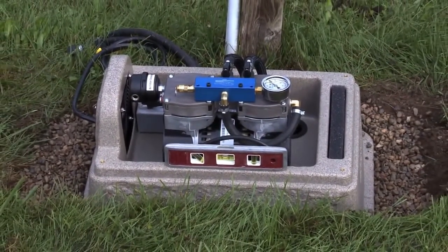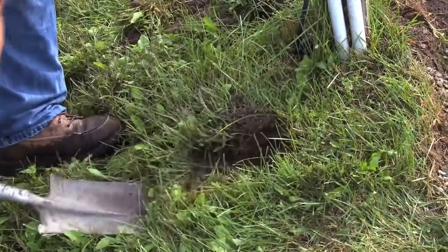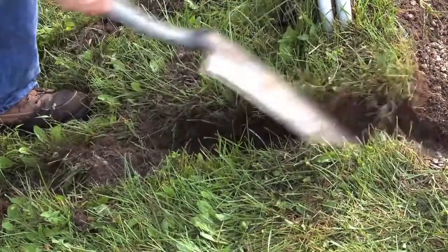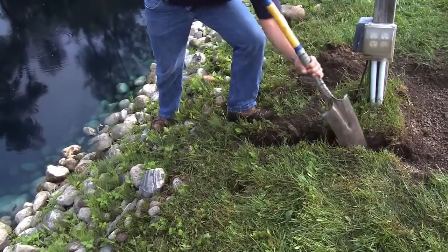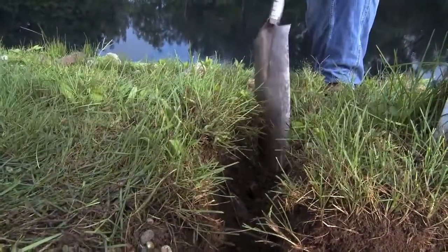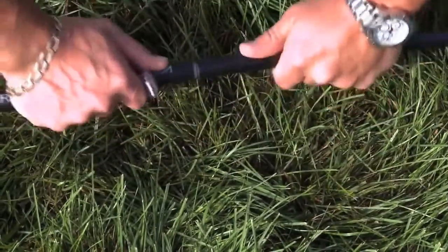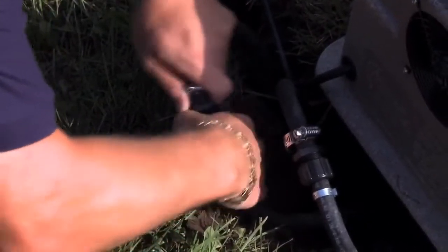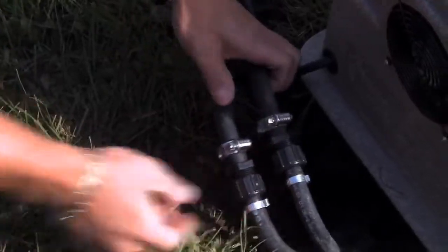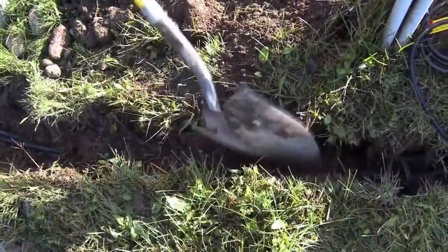With the cabinet set, you are ready to trench to the pond's edge. If your trench is going to be more than several feet away from the shore or in an area that will receive traffic from a lawn tractor or other equipment, it is recommended that you use AirMax Direct Burial Airline or place the EasySet self-weighted airline in a piece of PVC pipe to protect it from crushing. Be sure your trench is at least eight inches in depth. For longer trenches, you may need to connect multiple rolls of direct burial airline. If you are operating multiple plates, run a separate airline for each diffuser. Once all airline is placed in the trench, connect it to the cabinet using the provided connector kits. Backfill a few areas to keep the airline in place, but do not backfill the entire trench at this point — we will come back to this later.